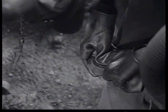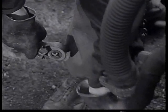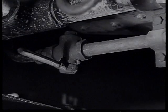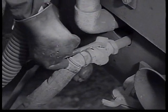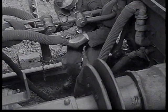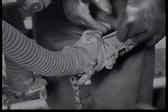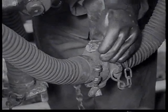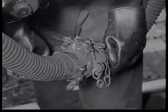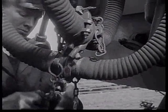Next the air pipes are connected. The mountings and ends of the pipes are painted to avoid confusion when coupling: black denotes train pipe and blue the high vacuum side. Small locking pins are provided to ensure safe connections. The pipes are connected crossed like this, under the screw coupling.